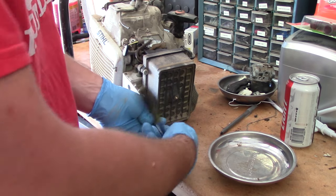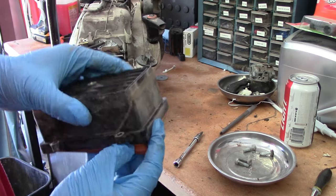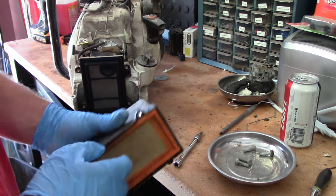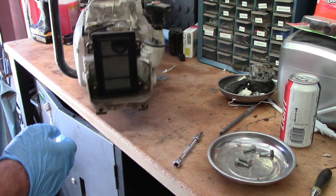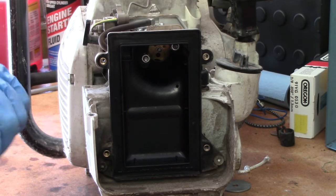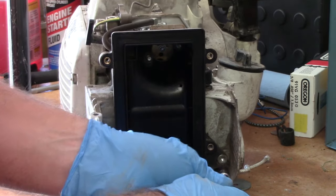Not even on all that tight. There we go — I'll pull that screw out and set it aside. Now we have access to the actual air filter. At the very least it definitely needs to be cleaned. These are very rough tools on stuff like air filters just by their design — they make so much debris and it all gets sucked in. There are two 8mm nuts in here that need to be removed, and then these two screws as well.